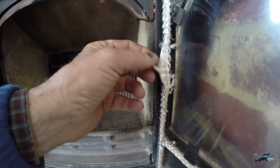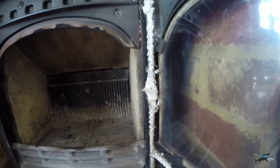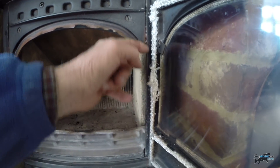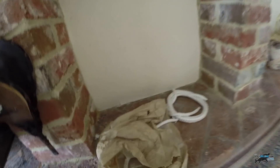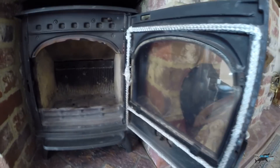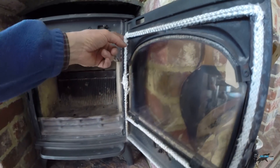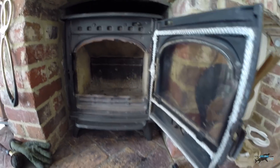Through the vent in the back and up the chimney, you do get tar and ash deposit going up there. You can see here it's just starting to fray after a season — this was put in about end of September, October for the winter season. It wears along here and I want to reseal that. I've got the new rope and the glue to go with it, so that's an extra job. But I'm just getting the chimney swept today, and then I will clean this out and reseal that.